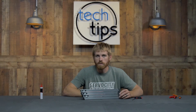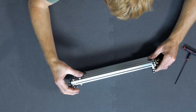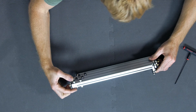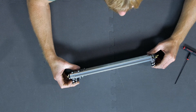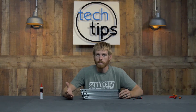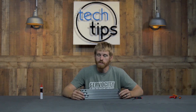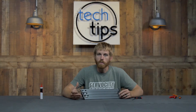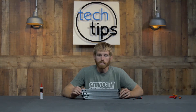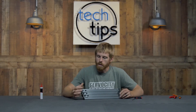Most of that adjustment comes due to the fact that 6-32 screws, which is the standard screw size used throughout the Actobotics building system, measure a diameter of about 0.136 inches. A number 6 through hole measures about 0.14 inches, so you've got four thousandths of variance between the screw and the hole it goes through.